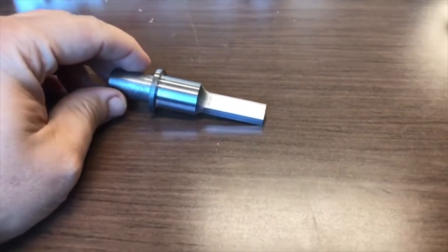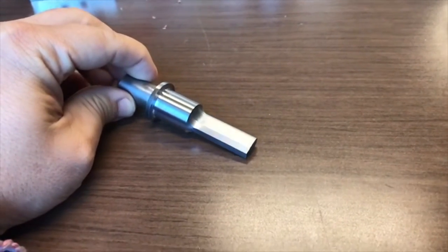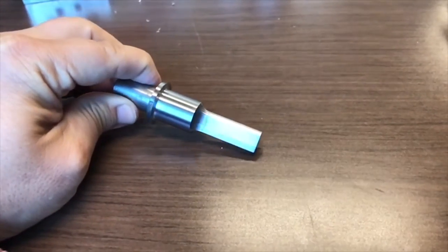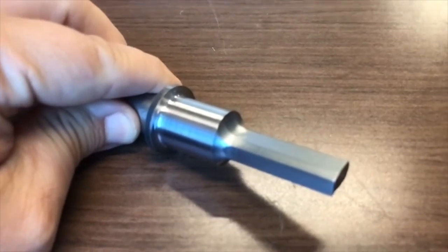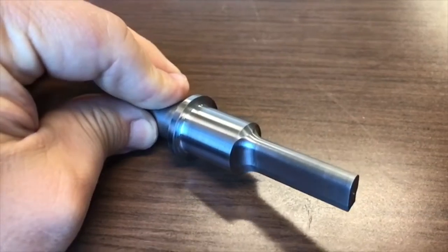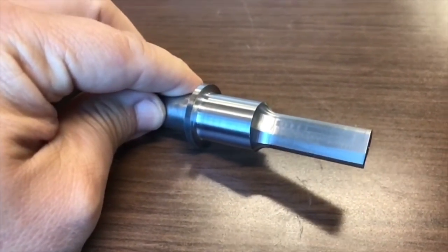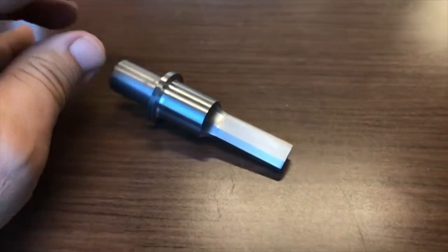And after all the grinding and all the different processes, here's my finished product. Here, you can see using the 1/4 inch radius caused it to blend out pretty nicely into the corners here. Transitions nicely with that. It's a little tricky and interesting trying to get all these different angles to blend out, but they did a good job with this right here. By the way, one thing I don't think I mentioned there is right here, I did zero out my cross feed there so I knew where to stop. Now, this piece right here is a unique piece, but the grind-all fixture allows you to do pieces like this right here.